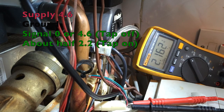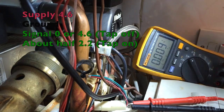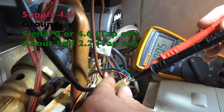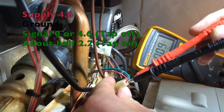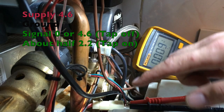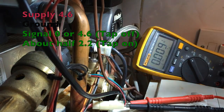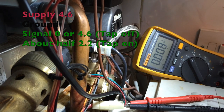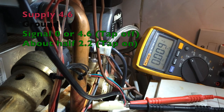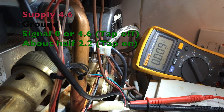And then we turn the tap off and it goes back to rest. That's how you test these. The positive voltage is constantly there at 4.6 volts. The negative is the ground, used like a neutral. The way this works is there's an impeller with a magnet on it. As you run the tap the impeller turns, the magnet goes past the sensor, and all it does is make the red and green wires touch. It does that fast enough that you get half voltage — you don't get full voltage because for half the time it's not touching, so you get half the voltage.